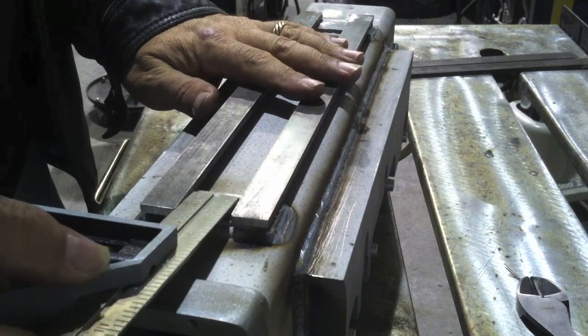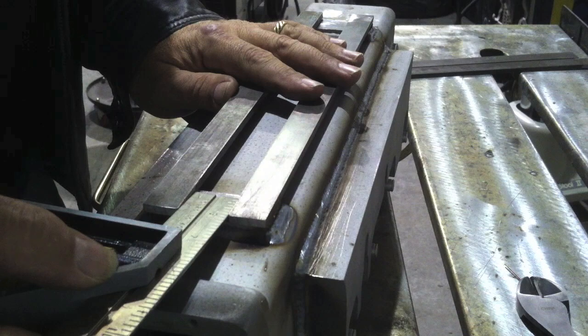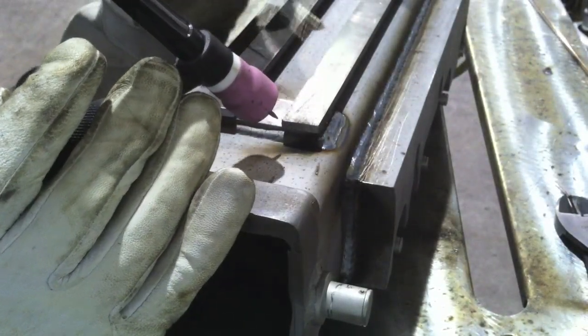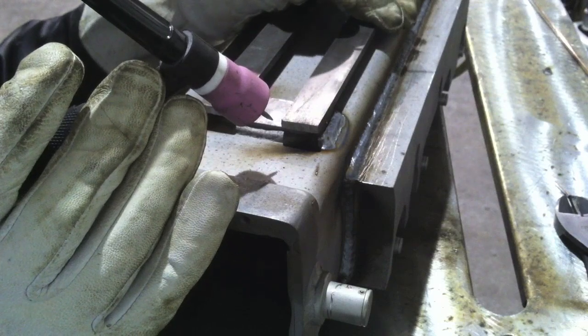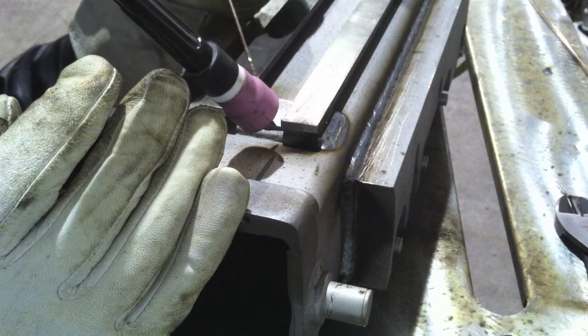Another requirement is just make sure there's a loose one-inch gap travel down there — he doesn't want it tight because it gives him problems in the field. So I just use the blade of that combination square to make sure it slides up and down there very easily.